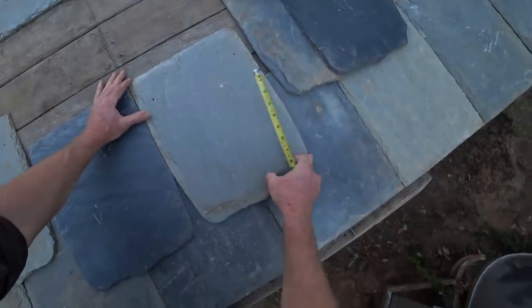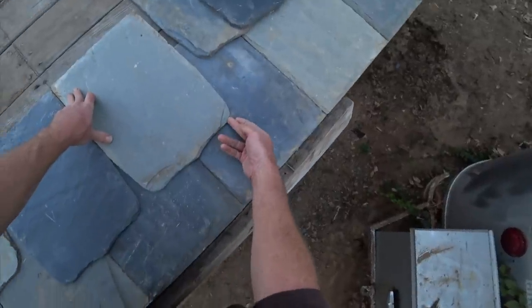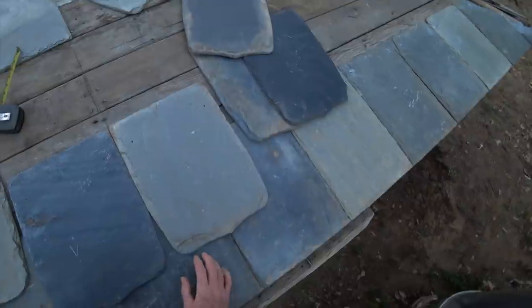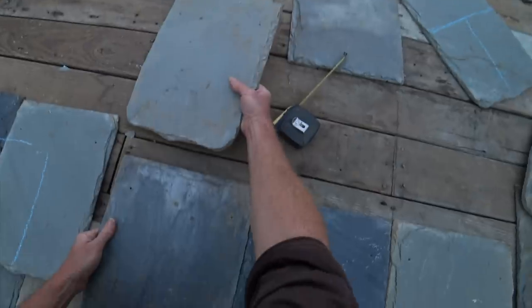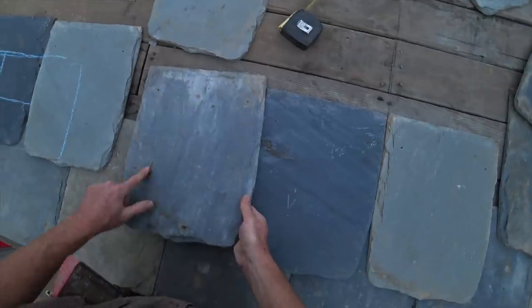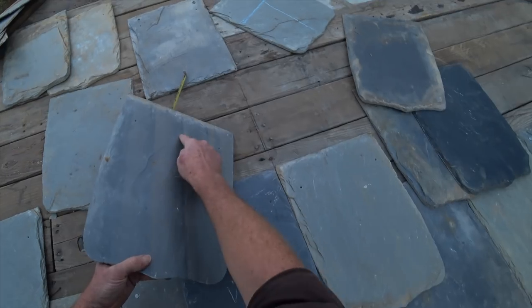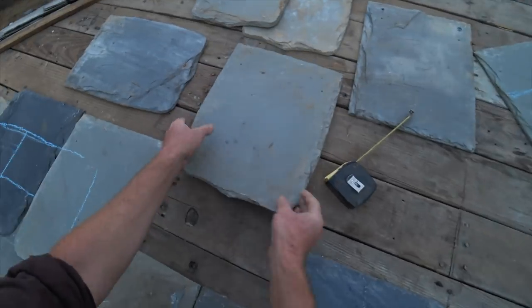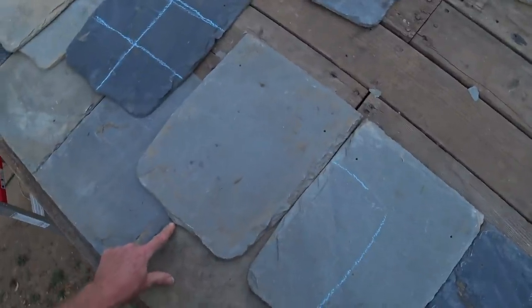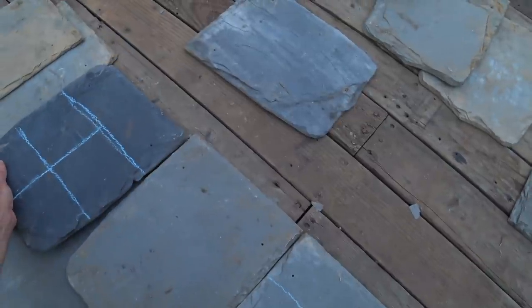This one's very thin so we'll put that out toward the edge. This one's medium, this one's thick. I'm going to lay out a bunch of these and see how they're working. There's kind of a big gap right there - it's rocking on this corner so we could just chip off that corner. I don't like the looks of this slate - it has tons of iron pyrite in it, which apparently can cause failure. If we don't have to use it, I'd rather not.